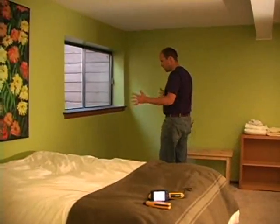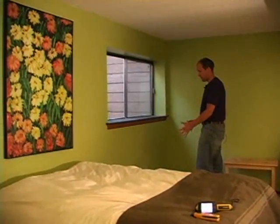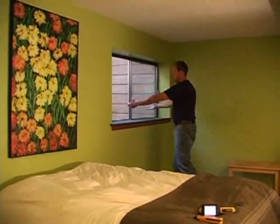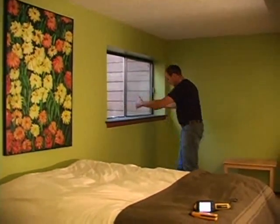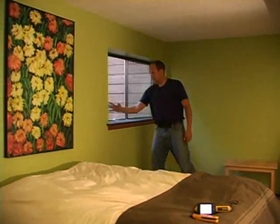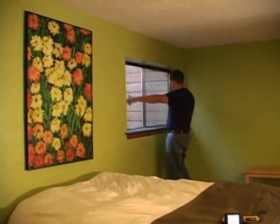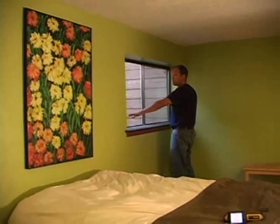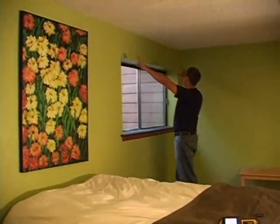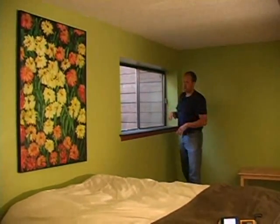The window well is a great place for a moisture inspection. There's really three places that you want to look. Below the window frame, because water can collect. If it's not draining properly outside the window well, it'll come into the basement here. And also second and third places. Second place is here, where the window frame is. The bottom corner sometimes collects water. And then there could be a flashing problem up on the top where the header is. So this area here sometimes collects water.